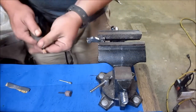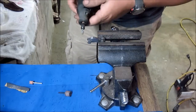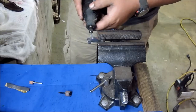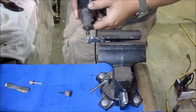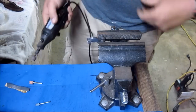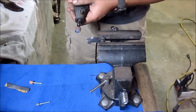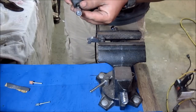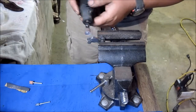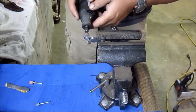Now we can get the green stone. The green stone — you're going to want to do it in stages, as that's a finer stone. What you're ultimately doing by doing it in this process is taking it down in stages. If you were to just use the orange stone and then go in to polish it, you're not going to get as smooth of a polish. You've got to take it down in stages before you polish it. When I put the sanding disc on it, put the Dremel on low — you really don't need high with the sanding disc because you're not trying to take material off at this point, you're just trying to smooth it out.